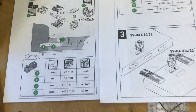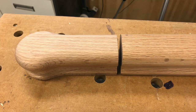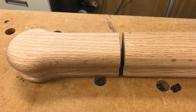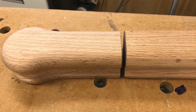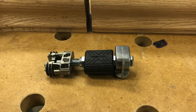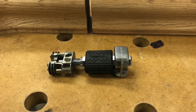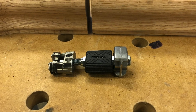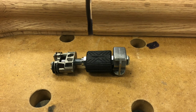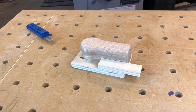This job involved making up a three-foot section of handrail with a terminal fitting at each end. I decided to use the corner connector so there would only be one hole in the bottom of the railing. The disadvantage is that the anchor bolt can't be readily removed if you make a mistake, so I put the anchor in the railing portion, not in the fitting — but you could do it either way.